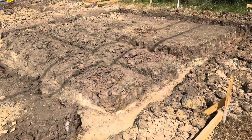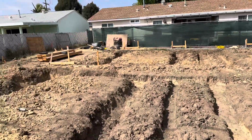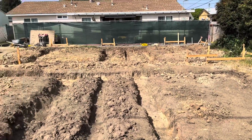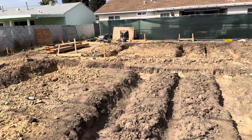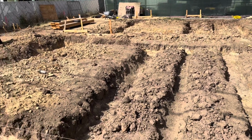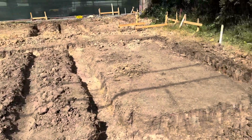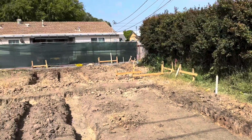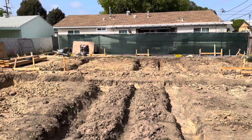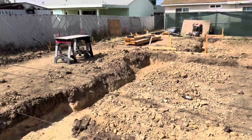But so just a quick video. We got two separate buildings. A little bit of a cost savings there, or value engineering, because when they're connected, if you have more than two units, then you have to do quite a bit more for fire, which can get costly. So by keeping them as duplex units, then we end up not having to up the plumbing code. And so you'll see we got 500 feet on the bottom, 500 feet over there on the bottom, and then we got a second story with 500 feet on top of each one.